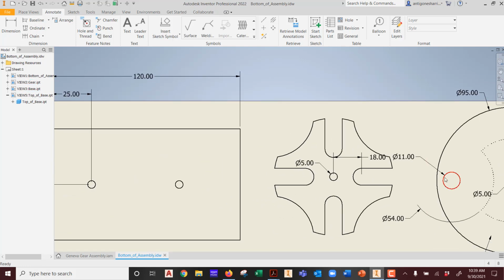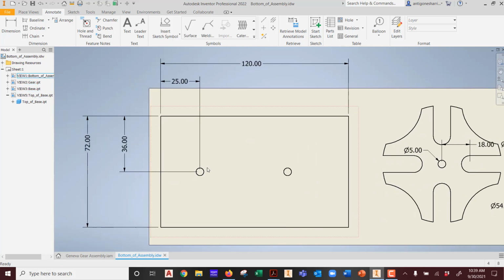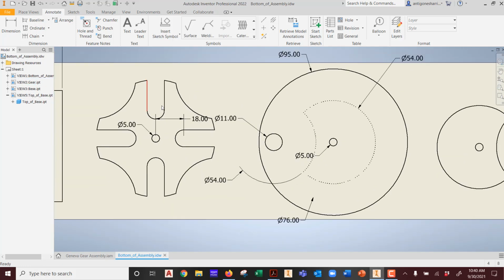That is the curse, is the way I'm going to phrase it. When you use this tool of using one part to build another part, the dimensions won't exist in that part, so you have to put them in manually. Like here, the slot sizes on this thing were created by actually using this guy. So therefore, you have no slot information on this detailed drawing.